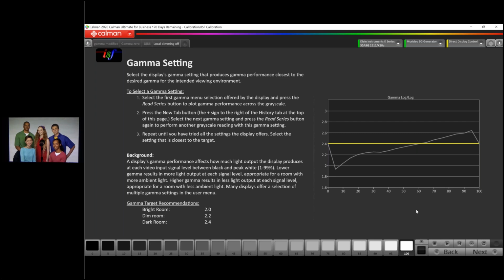Okay, so again, color came up 6 clicks, but as I'm looking at the image, it doesn't look oversaturated. It doesn't look way too colorful. It doesn't look cartoony or anything like that. Actually looks pretty good. Now, the other thing I'm noticing too is we did adjust the tint control 1 click into the green, and it doesn't really look green to me, but let's see if I can see a difference between 0 and that first click. I doubt it. It's only 1 click, but you never know.